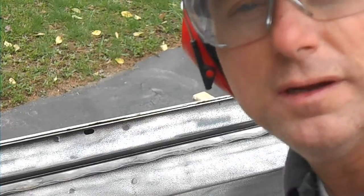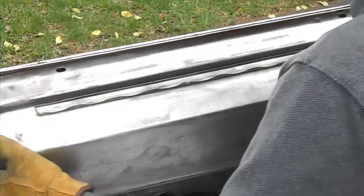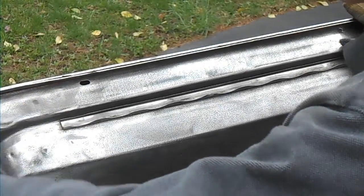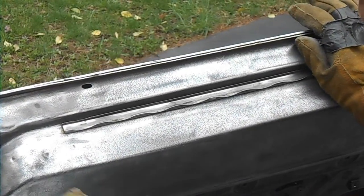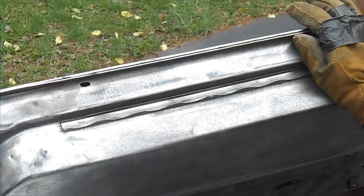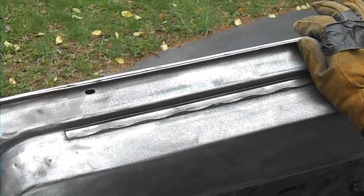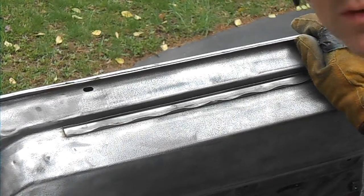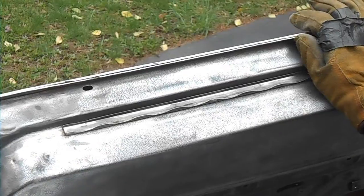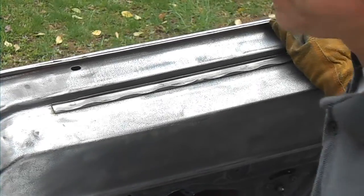I know I'm going to have some trouble at this front corner because it's probably not even on the camera. This front edge is where we welded on that patch, and I actually had to weld right to the corner of the door. So I know there's really no seam there. It's just weld metal. So I'm not gonna grind a lot there. I'm going to cut the skin on the top and then get most of it off, and then I'll look and see when I have a better vantage point how much I want to cut off of the skin and what I'm going to do about that flange. So I'm not going to over grind that corner and mess it all up. But let me turn it over now and start doing this other edge.